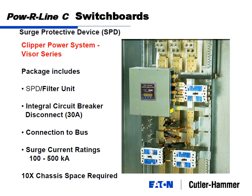Bolt on, I always say this, is a fixed electrical connection. Tight connections equal less heat loss. Plug-in is not a fixed electrical connection. Anything you plug in, even if it feels tight, it's not. There is a little looseness, and you will get heat dissipation at every loose point. That's why on a load center like this, a plug-in connection is just fine because your load's pretty light. Just nice and simple, nothing critical.